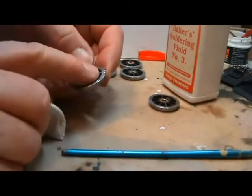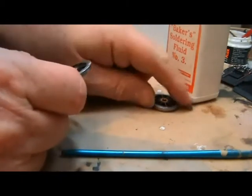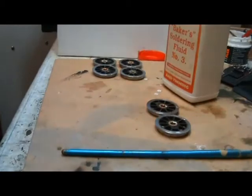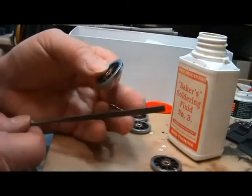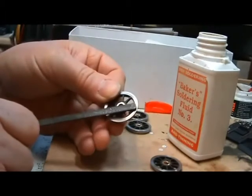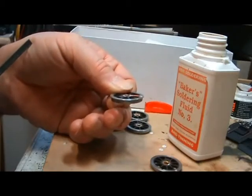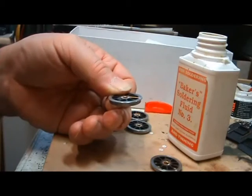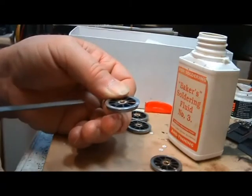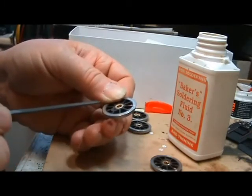There's probably a bit too much solder on there, but I shall take that down, file that off and clean that up. Using one of my second-division Swiss files, I've just gently taken off the excess solder top and bottom, leaving virtually a flat rear to the wheel. The fact that it sticks up slightly is not a problem because you've usually got a bearing in the way, so it's not going to snag on anything. You're not using plunger pickups, so that's not an issue.